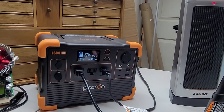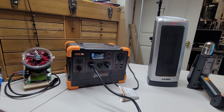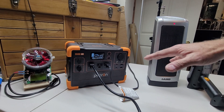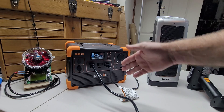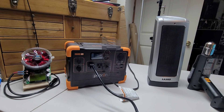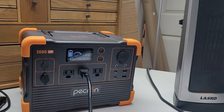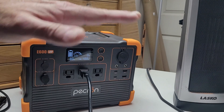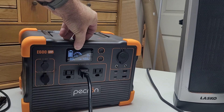Let's try adding a heat gun on low and see what it does — you can see the little gauge there, we're at 75%. If I put the heat gun into the next mode, it's going to add about 800 watts, putting it into the 1,600-watt range, which should trip the unit. And yes, it trips immediately — we get the overload indicator on the display. I can get it up to 1,000, and there we are at 1,200. It doesn't cut off right at 1,200, so there is definitely a surge capability here. After about five minutes at just under the 1,200-watt threshold, no signs of shutting off. I do like this little meter that shows you how close you are to tripping — kind of a little tachometer setup.